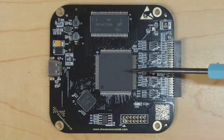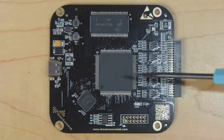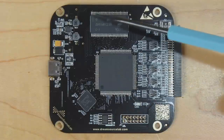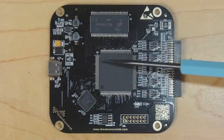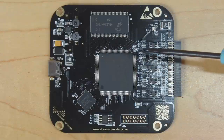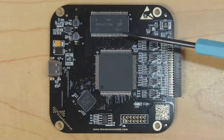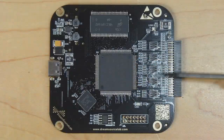If you want to sample at higher speeds with more pins enabled, it's easy to enter a situation where the total transfer rate exceeds that 200 megabits per second ceiling. When that happens, continuous transfer to the PC isn't possible anymore. That's where this chip comes in — a 32 megabyte SDRAM made by Micron. In buffered operation, the device samples at full speed — up to 400 megahertz — capturing data until the SDRAM is completely full, and then the FPGA transfers the data through the FX2 up to the PC, which is really useful for capturing short high-speed bursts.